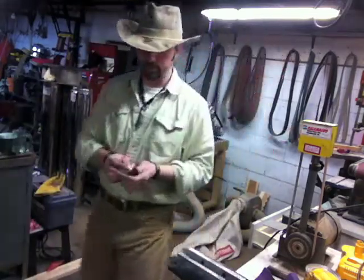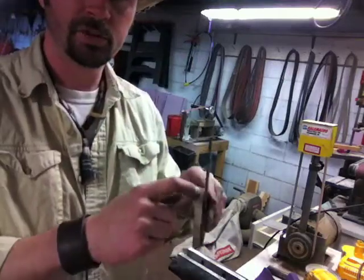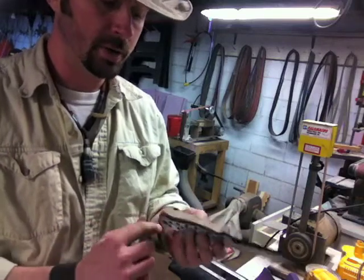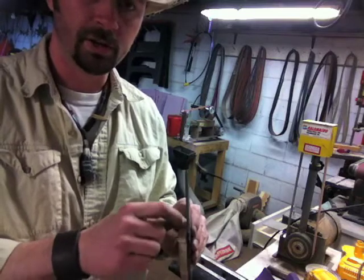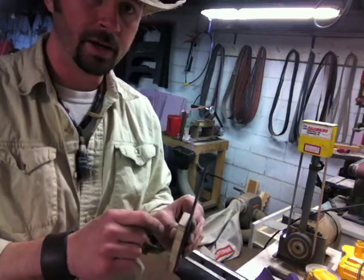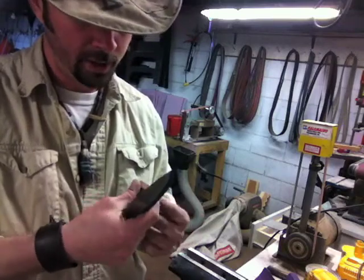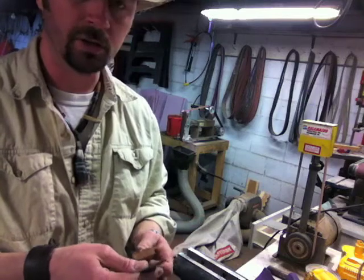Once I clamp it up, one of the biggest things to watch for is that I've got to clean up this surface right here in the front. Like I said, all this area around here is going to get finished later, but this is one area that you don't come back and touch. So you want to make sure that you wipe all the epoxy from there, and you get a Q-tip with some acetone in there, and get all the glue out.